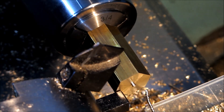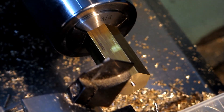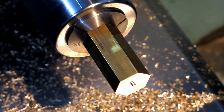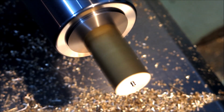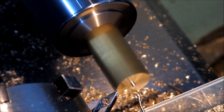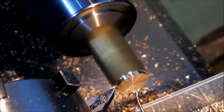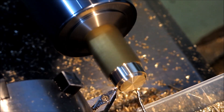Undo the collet, move it up to the stop. Running at 2,400 RPM using a carbide insert made for cutting aluminium. I'd rather like it with brass — gives you nice chips that are manageable.